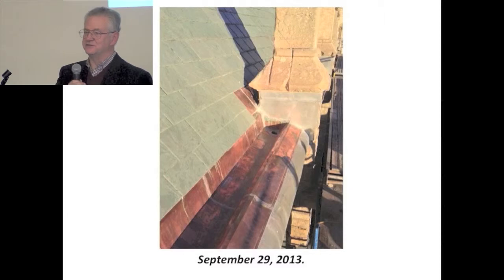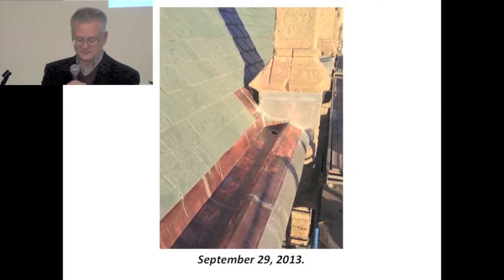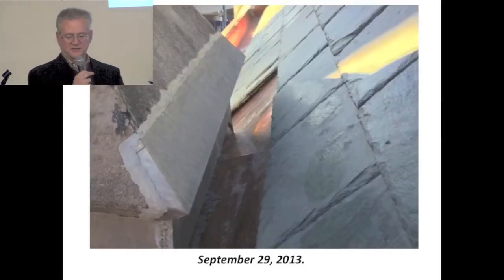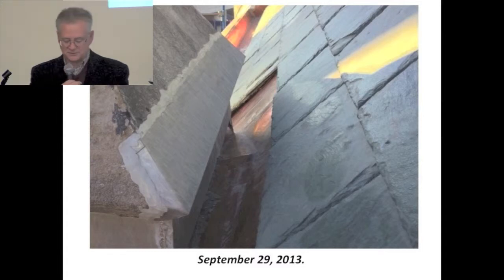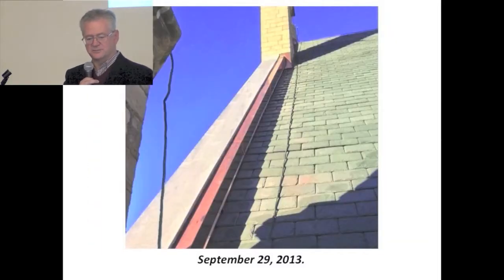And the finials are about 15 feet on center, these big stone finials here. So what they did is they flashed all the way around the finial. Lots of handwork. This is a photo of the back side, and you can see this little saddle that was made, so the water runs down both ways. But they continued the metal, this freedom metal, zinc covered metal, up to cover the bottom part of the stone finial also, so it wouldn't be damaged by ice and snow. Here's a close-up of the flashings on the back wall of the church.